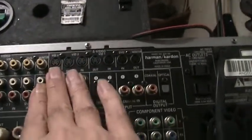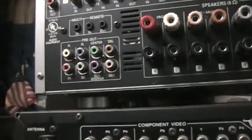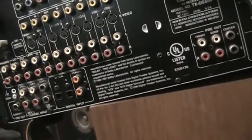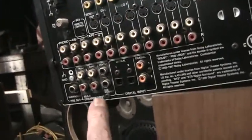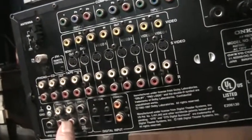You can go direct in — all eight channels or six-channel — so you get your front left, right, and so on. You can pass right through on RCA from the pre-out section. Now this one was only 5.1 — I thought I got rid of all those. I've got mostly HDMI 7.1 and a couple of FireWire 5.1 pieces. I keep that Pioneer over there for my 5.1 testing because it's got a horribly slow processor, and when you mix 5.1 with anything higher — even 6.1 — you really notice the latency.